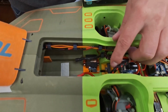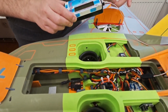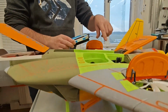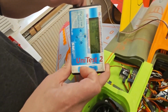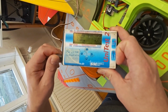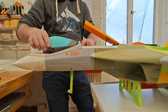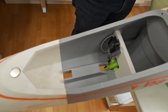I remove the cover, and here we can see it. This is a stronger servo, and this tilts the whole EDFs. Now they don't run exactly to the end position, because it runs just over my servo tester and not over the flight controller. But we can also see the current here. So check that the current doesn't rise in the end positions over 300. And we also check that this leg is running the same. They are both coupled. They run the same.